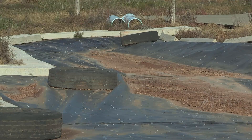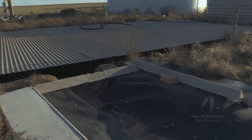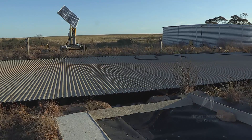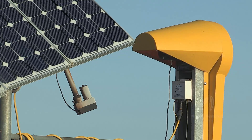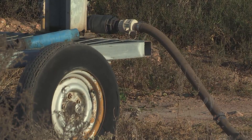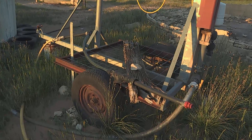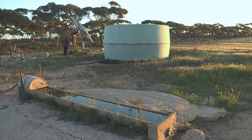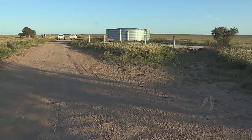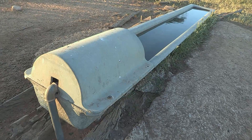We've got an underground tank there which is about 30,000 gallons and we pump out of that just with a Honda inch-and-a-half pump into the bigger tank, and then I've got a solar pump there which can pump all over the farm. It probably only gets up to about 35 psi from here to the north of the place, which is the highest point, but down south it runs low — you don't need a big pump because it's not pumping to high elevations. I've got another 600 watt system down the bottom which, when we get stuck, we push up from there. Every trough's got a tank on it. Out the back we do pump to a high point, and it gravitates to three other points which have got a couple of thousand gallon tanks with a trough, just to get a bit more flow.